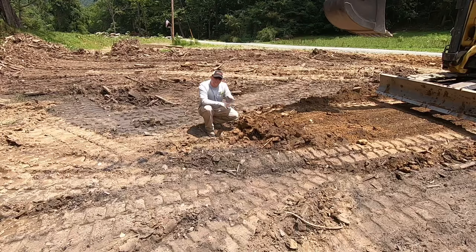We're going to just barely dig that blade in to where we start collecting material over a long distance, a little bit at a time. That way we don't cause an indention from biting into the ground. So we're gonna start collecting and push it all the way out, and you guys will see how this develops.